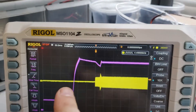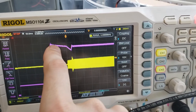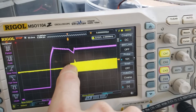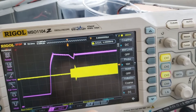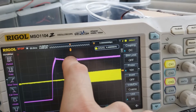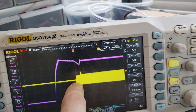This purple line is our voltage going from the 14.4 that it's resting at up to the 60, 65, 70 volt range. This turns on rather quickly — about 40 milliseconds after this button engages, this voltage is already up at its peak. And if you look even closer, about 150 milliseconds after the voltage reaches its peak, the radio actually starts putting RF into that amp — that's what's going on right here. This little dip I think is just a load issue; it's all happening really quickly and it has to take a moment to respond. The power supply has to compensate for the transient, and it's a pretty large transient. It's just a little transient dip before the power supplies have enough time to compensate the voltage back up. As you can see, our power supply is turning on quite a bit sooner than the RF is, which is perfect.